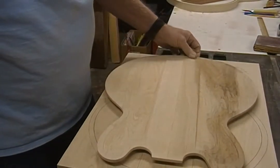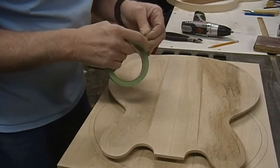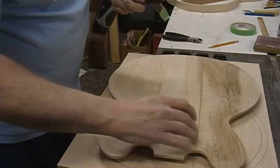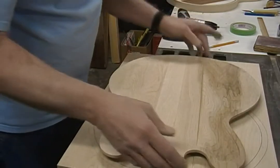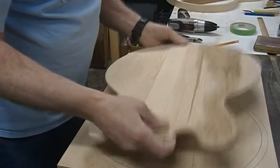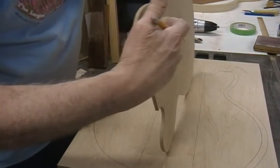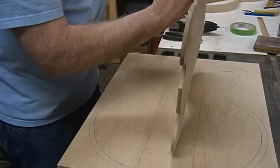All right, so I'm going to get set up for the little drill and pins. All right, back in here. So I want just the teeniest little bit of depth on this brad going in here. Primarily, although where I'm going in at these places are on the rounder part of the top, all of these carved areas are 1/4 inch thick, so we want to stay into the thicker areas. And just looking at that, it's not going to be a problem on either end, really. I'm just going to go across from where the hump is right here and call that good. And that.